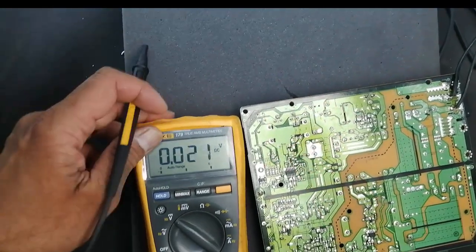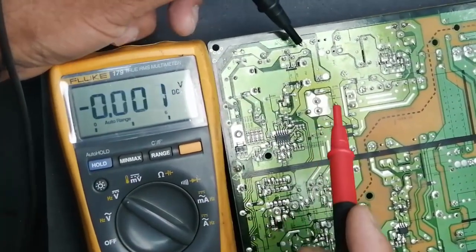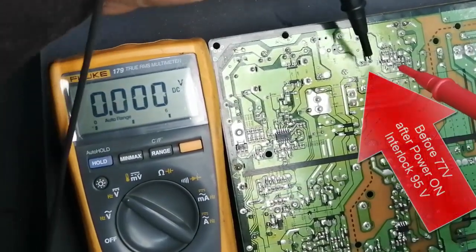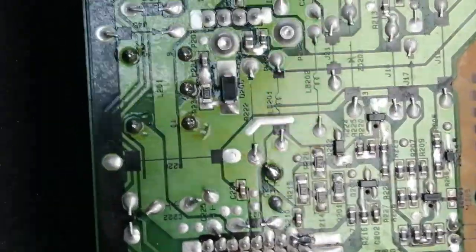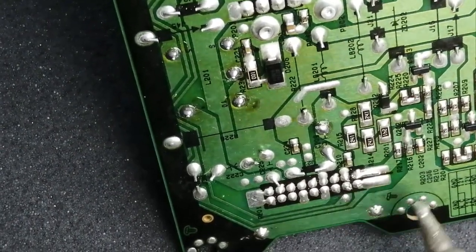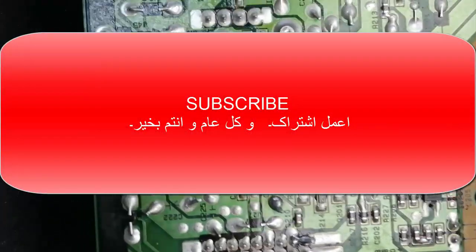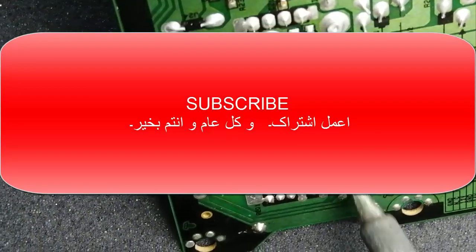When we did not connect the power-on interlock, that was 78 volt — now it is 95 volt. So this board is now working perfectly. The standby voltage and power-on command are working. Now it is 95 volt — before we installed the jumper it was 78 volt. I remove the jumper and this board is now working correctly. If you think this video is good and it satisfied you, you can subscribe.